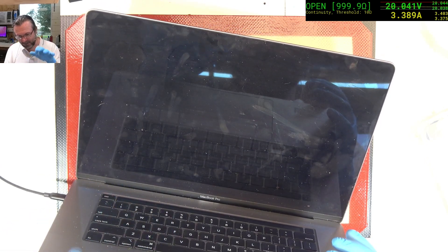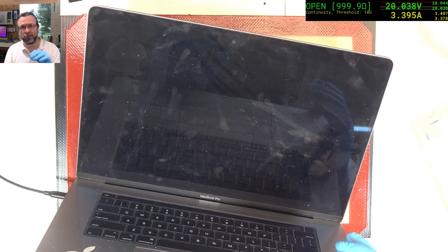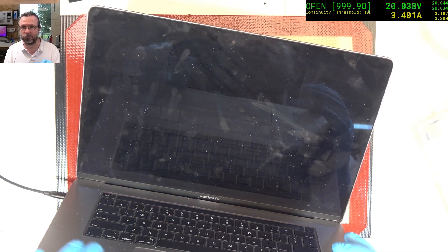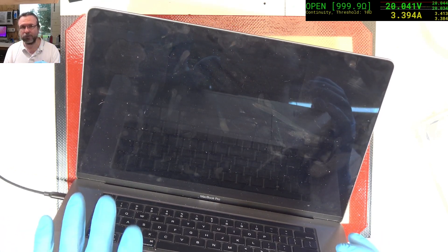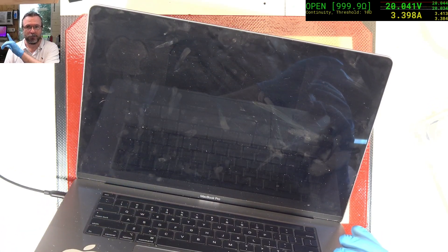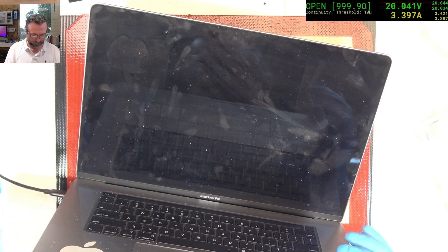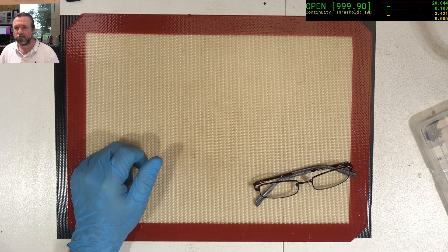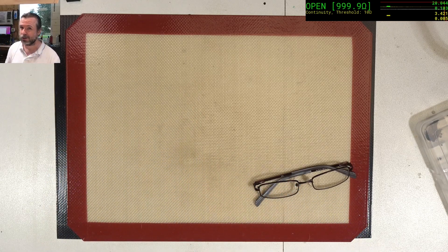The reason why I would prefer they didn't do this is because there's always a chance that we're not going to be able to get out of DFU mode if they have put it in there. So I'm going to move this over to the iMac, plug it in, see if it shows up as DFU. And sure enough, it is in recovery mode, so I'll now proceed to try and revive it. Fingers crossed, it actually does.